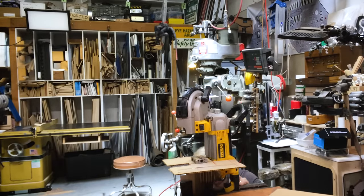First step, I gotta swap out the jaws on my vise so that they can grab this big piece of aluminum. The vise jaws don't open up to 10.5 inches, but they do swap out so I can actually get 10.5 inches of throw out of them. It's one of the cool features of a good machine vise. And I recently tuned this puppy back to health. I took it all apart, put it back together, cleaned everything inside, adjusted the preload. It's a nice vise now.